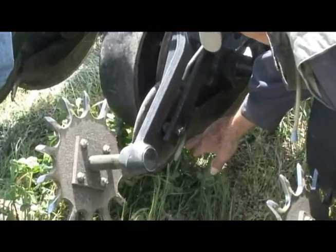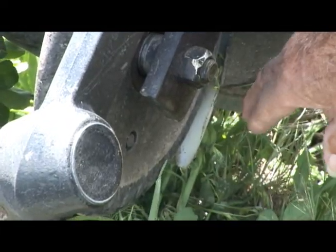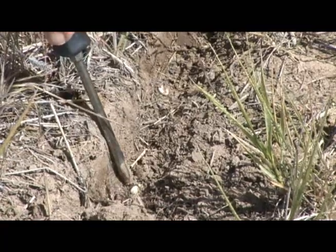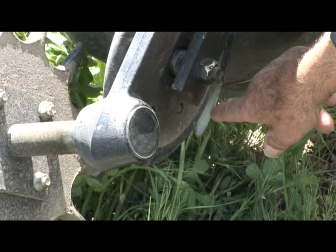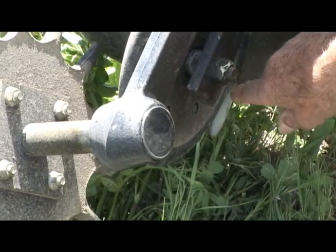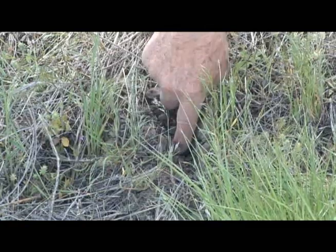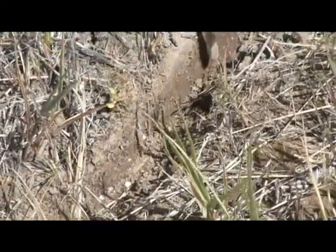You have a nylon strip here, and as the seed comes down, this is pulling and forming a really nice furrow. Then this roller wheel here comes behind and places the seed in the bottom of the furrow that you've made with the disc in front. This pulls away any dry dirt and moves it out of the way as the seed drops down, and then this immediately closes behind so that the wheat is always in the moist soil. You can see little bits of 11-52 fertilizer that's been put right in with the seed.